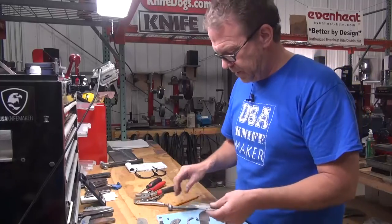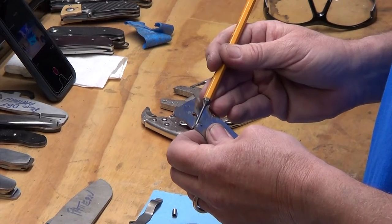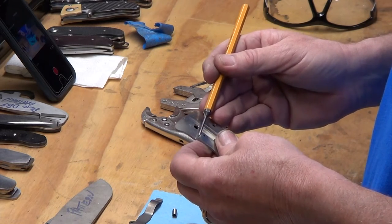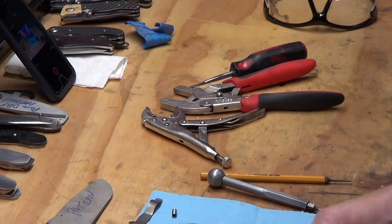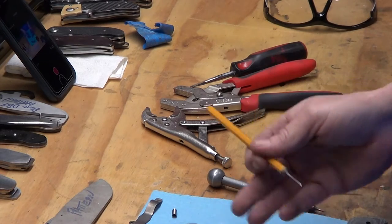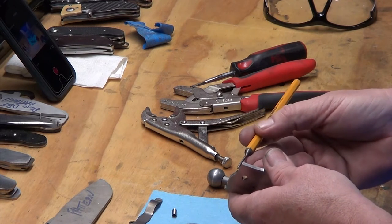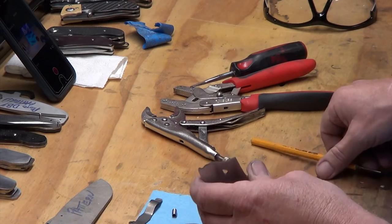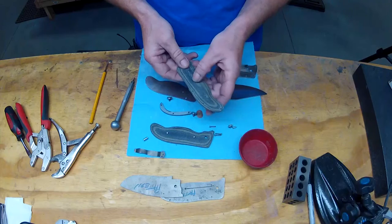You can't just keep adding carbide because at some point the circuit gets too weak to really push anything in. This will wear a bit when your knife is brand new — it'll be a little stickier than you like. Just keep using it and you'll see some slight wear and get better feel on the lock face as it locks up. When we ground this we were at about 50% lockup, but trial-fitted all together and tight, we're getting 20–25% lockup. The plan was always to come back and touch up the lock face for final fit, and with the ramp system it's just a quick touch to get that 50% I prefer — leaves plenty of room for wear and it's not going to pop back on you.